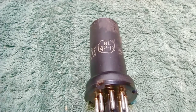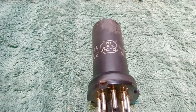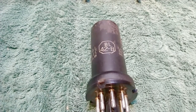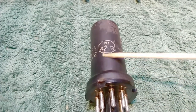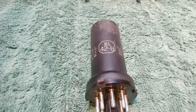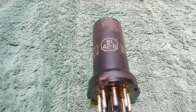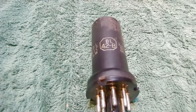The idea was to drop the voltage — kind of the same way as what my friends call 'curtain burners,' those radios with a resistor line cord that was actually built into the line cord. What this does is drop the voltage on the filament string so that you can run the other tubes without a transformer. They made these radios as an inexpensive option rather than putting a transformer in the radio.